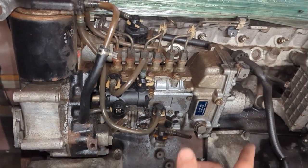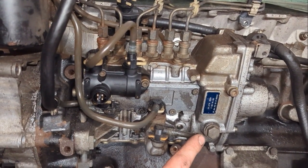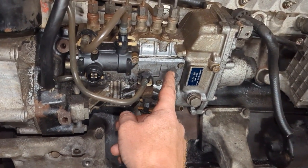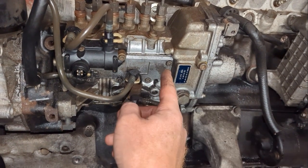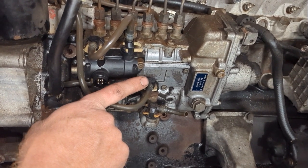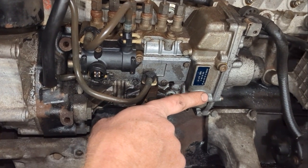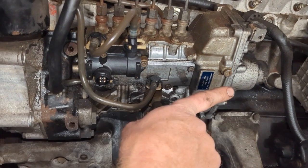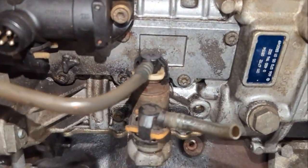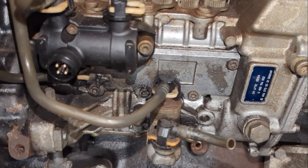You can use what you already have. Now all I need to do is put a fuel source — a little tank of diesel — onto this. The last thing you need to do, since you don't have a computer, is move the rack. By default the rack is all the way back — that means your engine is off, there's no power and the rack is pulled all the way back. What you do is take this off — there are six T30 torx screws — this is called the rack plate or rack cover. Take that plate off and inside you'll see what the rack looks like.